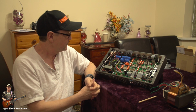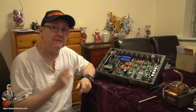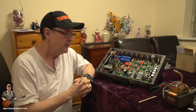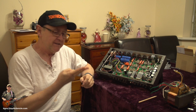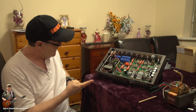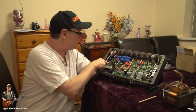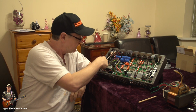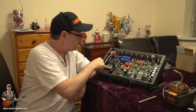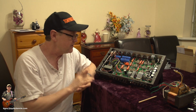Well, think about this. When we connect the mains, in England here, probably in Europe, probably where you are as well, USA, well, you'd be doing it the other way around, but don't worry, it's the same thing really. You've got this 240 volts coming in on two wires and the ground. Well, let's ignore the ground for a second. Now, those two wires come in and end up coming into this amp and go into that little board there. They go through the power transformer, into that switch, back down here, out to the switch, and down to that board, and they go through the power transformer and out at different voltages.